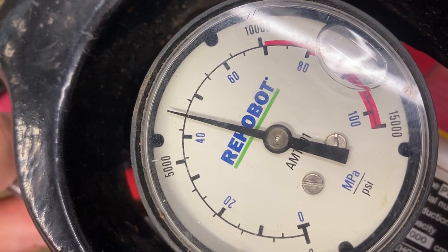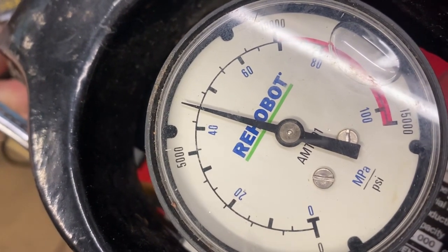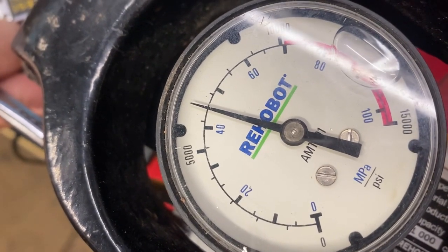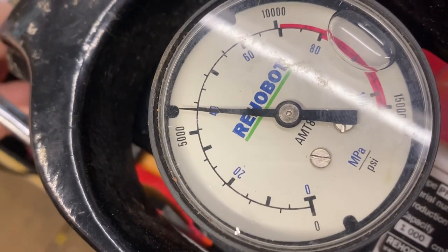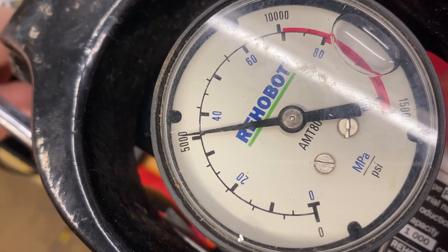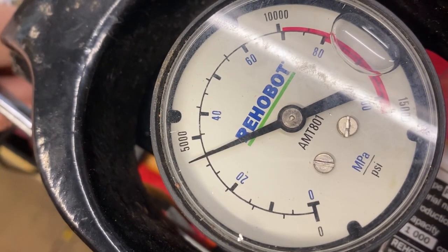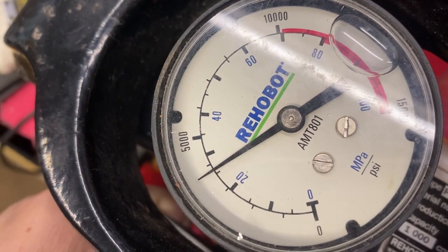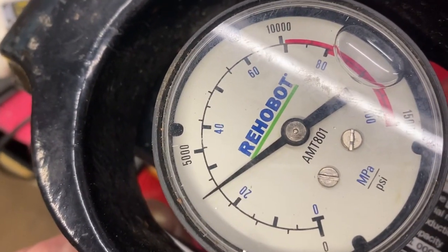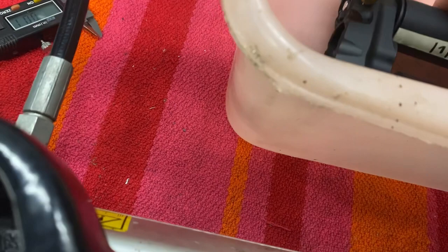Let's see if we can use that. I want to bang the valve. Should start dropping in a second. Or not. Yep, there it goes. Let's take an interesting measurement, like at 250 bars. Does it stop there? Yes, it does. You can take that off because it didn't burst at 450. It's not going to burst at this pressure.